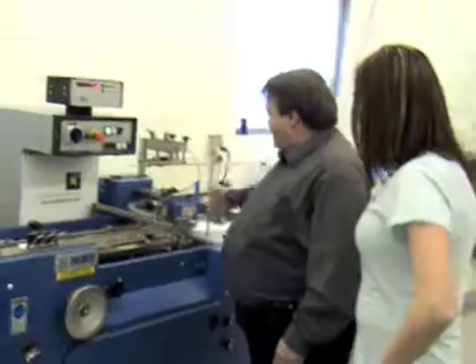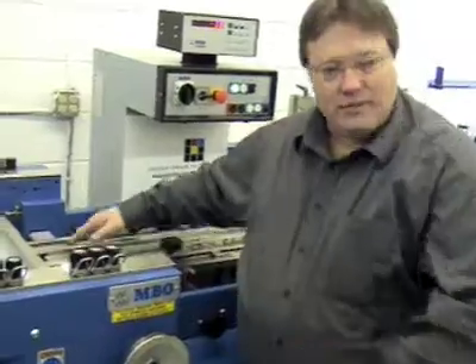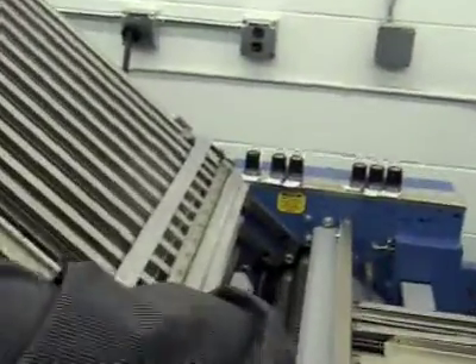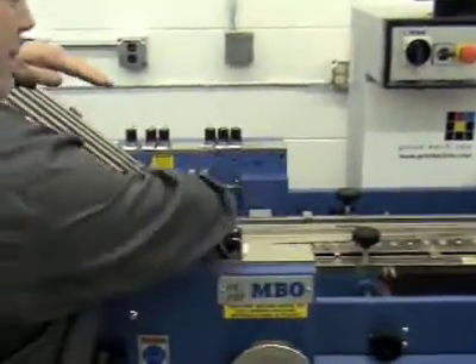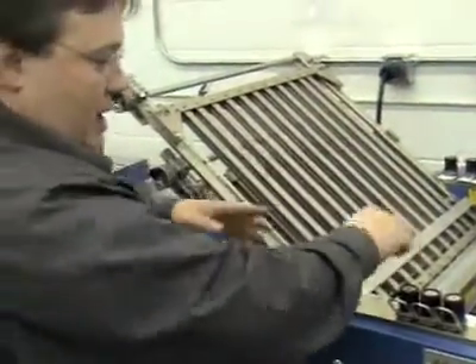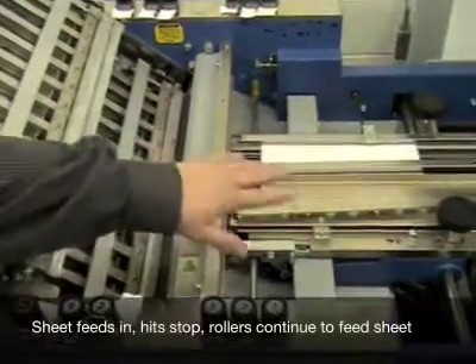Let's talk about the machines. Basically, we load our pile of sheets here. A sucker wheel creates a vacuum to pick up the sheet, runs it down to register to get it nice and square. It's got a series of rollers that run it through into any plate that happens to be open. The length of the folds is set up here. The sheet hits the stop while still being driven by the rollers — that makes it buckle, which is why it's called a buckle folder. That buckle becomes the lead edge of your sheet.